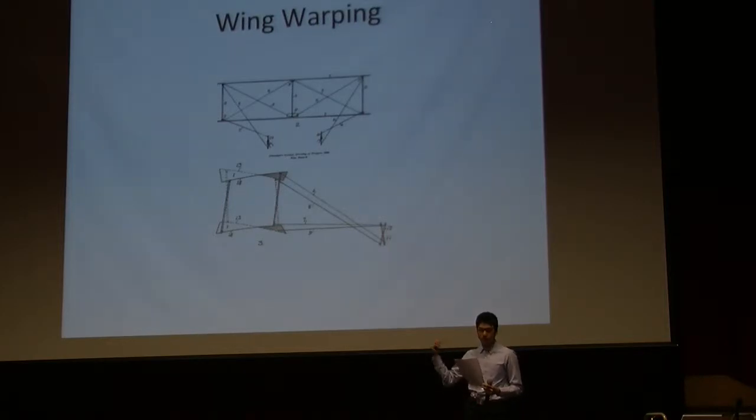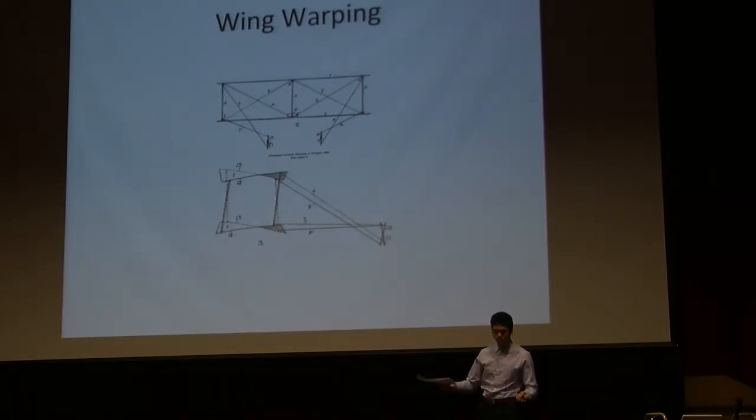Theoretically, this is more efficient than the jointed solid panel kind of design of a traditional aileron, mainly because there are no gaps between the panels. It's a single surface, so there's no space for air to flow in between the two sides of the wing. And there are also fewer obstructions for the airflow, like hinges and separate panels.